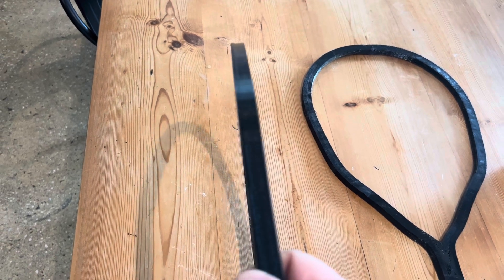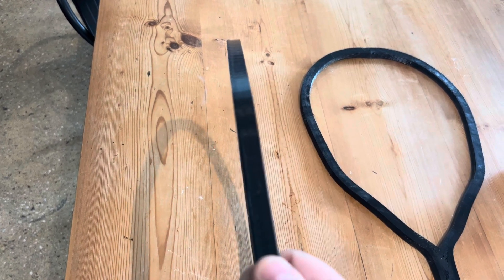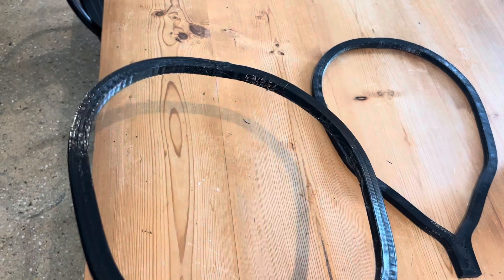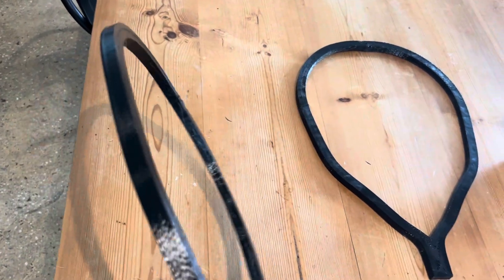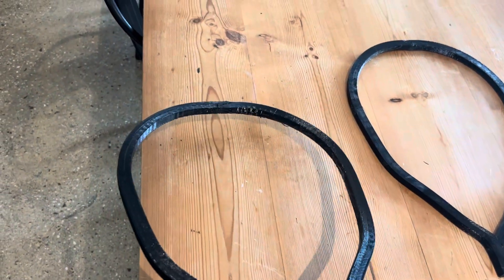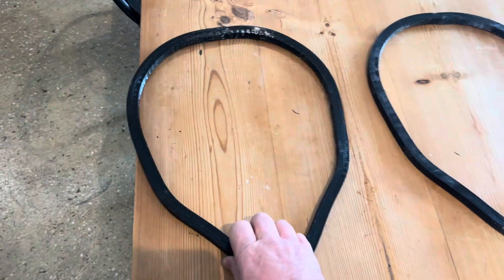I played with the temperature so you can see a real shift in the outer wall diameter there, so calibration and drying I think may end up being the key. It stuck great to a 50 degrees Celsius bed with glue — you can still see some white glue on there. I use a straight glass bed on my 800mm printer.